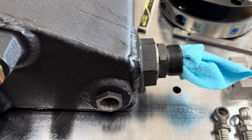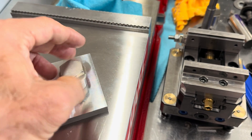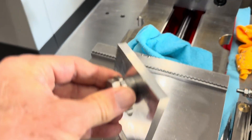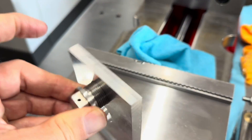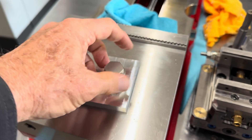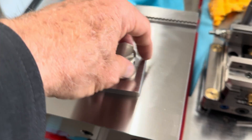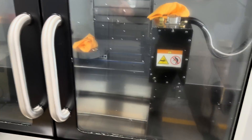We can actually cut this tighter — because it's an oil drain plug — than a nut would be. We cut that, take the old piece off, and weld the new one on in its place. The CNC allows us to cut any size we want. And when we cut a new one, look at the difference. You saw how loose that was — look at this now. Rock solid. There's no free play, and you couldn't really achieve that any other way than by cutting special threads. On a machine like the Haas here, this is really easy to do.